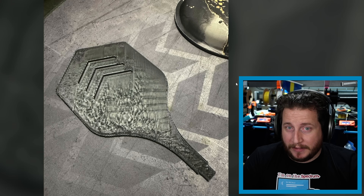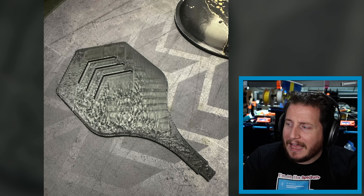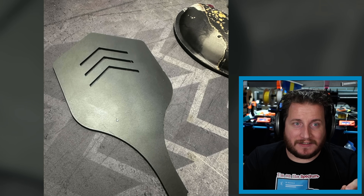The best thing to look at is your steps per millimeter. Grab some filament you can mark on — white filament is often the easiest. Insert it, get it purged out through the hotend, then from the entrance to the extruder mark 100 millimeters up. Tell the machine to extrude 100 millimeters and see what happens. You can do this with 50 or 25 as well, but 100 is easy and gives you plenty of time to determine if it went too far or not far enough. In this case we'd guess it's going too far. Remember: if your ruffles have ridges, you are either too close to the bed or you are over-extruding.